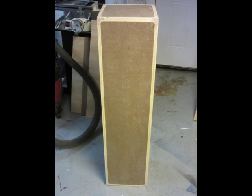As I mentioned, when you're doing the inlay, you always want the masonite to go down slightly below the surface of the pine stringers because you want to get them flush, but you don't want to be sanding the masonite itself more than necessary. So the idea is to bring the stringers down to the level of the masonite. I don't know any other way to do this much wood removal with any other kind of sander and not booger it up.